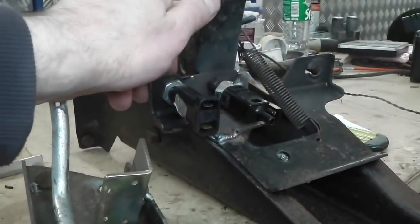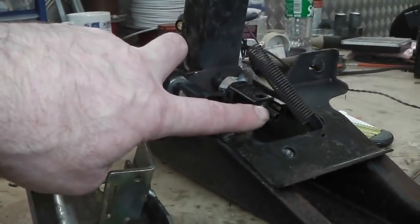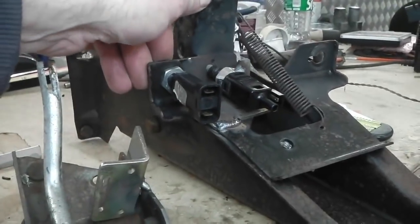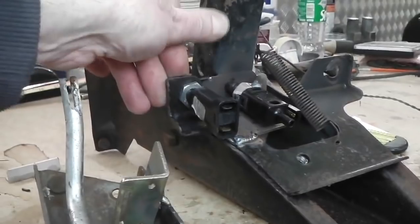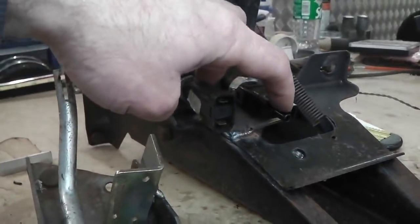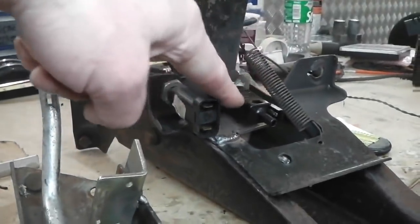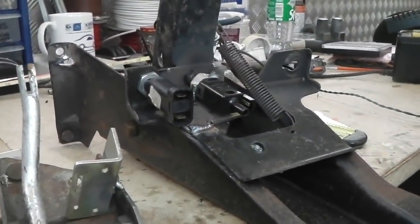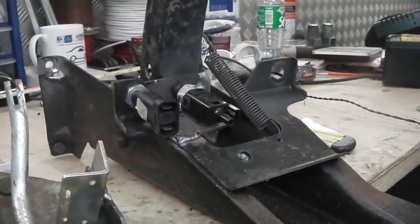Mechanically operated. So the vacuum is reliant upon this port in here being shut. As soon as you hit your brake, it actually opens that valve and dumps the vacuum out. So the cruise has got an extra level of safety as well, and also 2 electrical contacts that also kill the cruise. So 3 items there knocking the cruise out, as well as the speed sensor. When you drop speed, it knocks it out. Also it has to be in drive, so plenty of coverage.